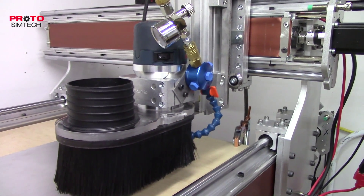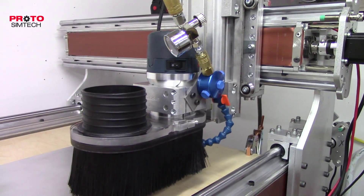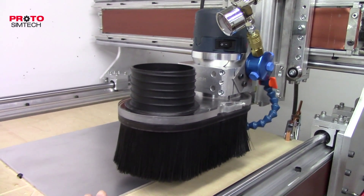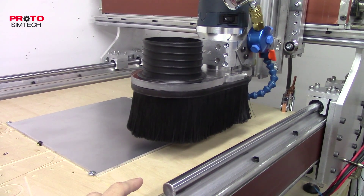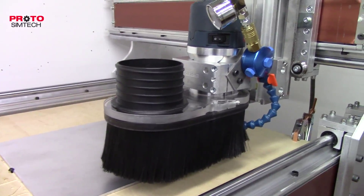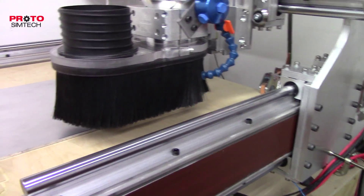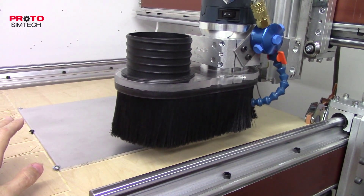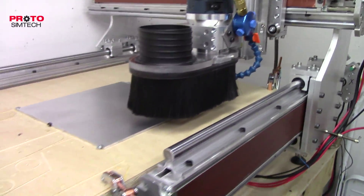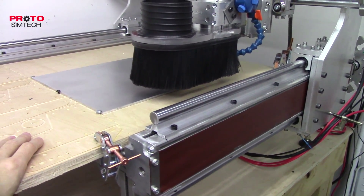When I put the machine completely back together and tested the runout again with the indicator, I was getting the same thing — less than a thousandth of an inch between the front and the back of the machine. That's just crazy. I checked for squareness again and the machine is perfectly square, as it was when it was assembled before with the previous system.